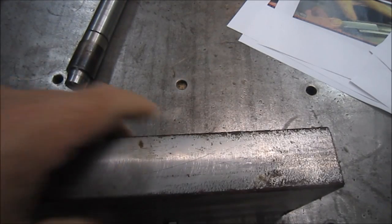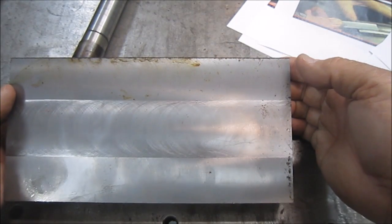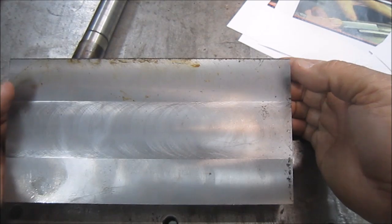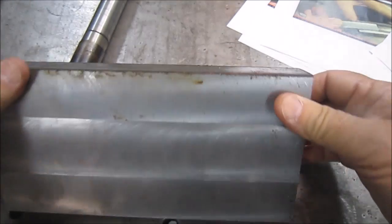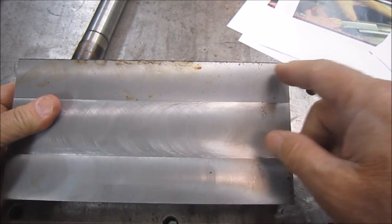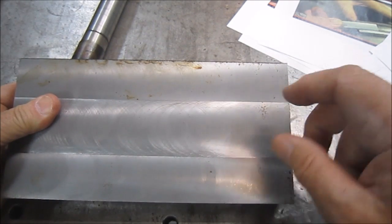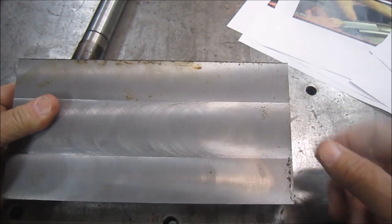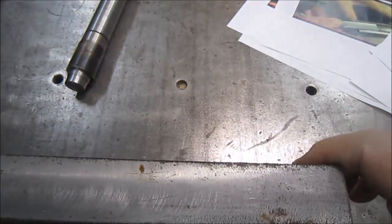And then, if you remember when I built the fingers for my finger brake, I had this piece of steel. And so this has been squared up on 2 sides and 1 face. So I'll end up going ahead and cutting. It's 1.25 inches thick, so that'll give me my 1.25 inches. I need 1.5 inches by 3 inches. So I'll cut that out of the block, square it up, and get ready to go.